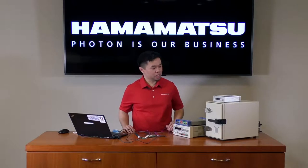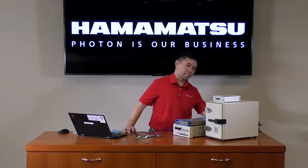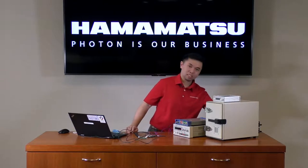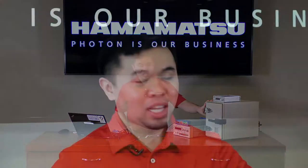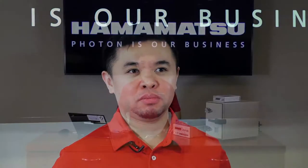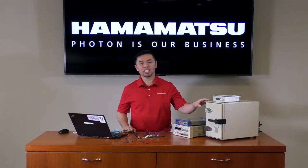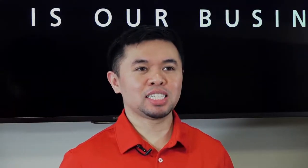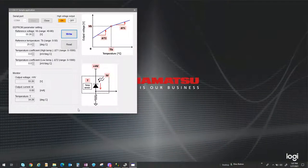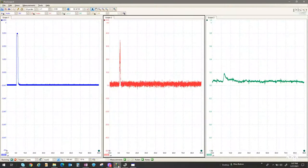For our experiment, we're using an adjustable LED light source. A fiber cable connects the LED to the dark box. Inside the dark box, we have our MPPC with evaluation kit as well as an APD module and a photodiode so we can compare the three detectors. We'll measure the response from all three detectors, then we'll gradually decrease the intensity of our light source and see how all the detectors respond as the intensity decreases. So let's look at how these detectors respond on our oscilloscope as we gradually decrease the intensity of the light source.